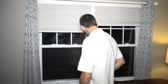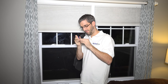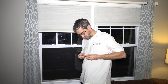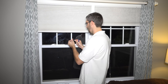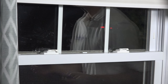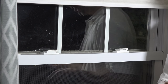If you needed to, you could actually open the magnet case up — there's a little tab on both sides, and using a flat-head screwdriver, if you stick it in and pry down on both sides, you can access the internal magnet. It's a white magnet that comes out, and this piece is even smaller than the plastic casing. So you could fix this using epoxy or some sort of bonding agent onto a very small edge or lip, so that if your window didn't have enough clearance for the whole magnet in the case, you could still protect your window with just one sensor.